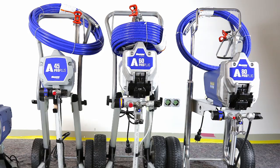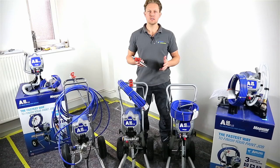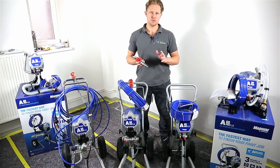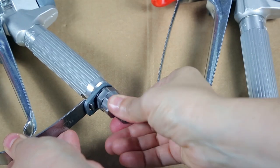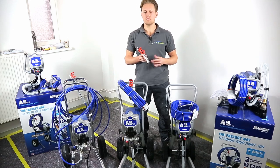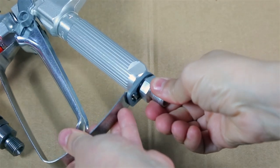The smaller units require a smaller hose so that the delivery pattern remains even. All models in the Graco Magnum range come with the Graco SG3 spray gun, except for the smallest unit, the A20. The SG3 spray gun has a comfortable handle, solid grip, and swivel joint. The swivel joint makes workflow easier since the hose can be quite rigid, allowing you to move freely when working. The SG2 spray gun, on the other hand, has no swivel joint, which might make workflow more difficult.